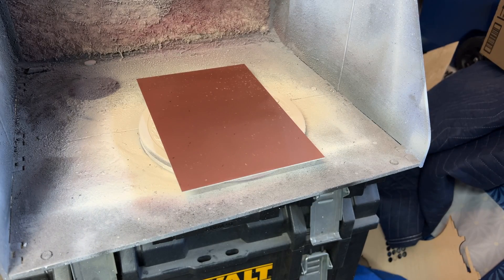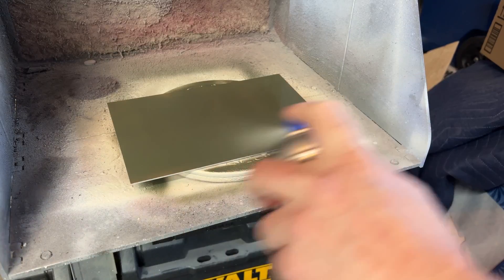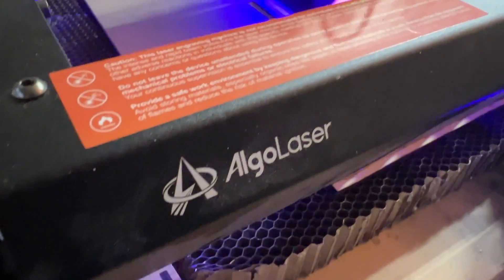For the next part, I'm just using a spray bomb of whatever color I happen to have around. You generally want something that will work with your laser — my laser doesn't like white all that well, so any of the darker colors will be fine. Find a color that is opaque to cover the board. The next stage is I take the drawing, put it into the laser software, and tell it to etch out everything in the negative so the traces are the pieces that have paint on them. I have an Algo laser, which I really like — affiliate links are down below.